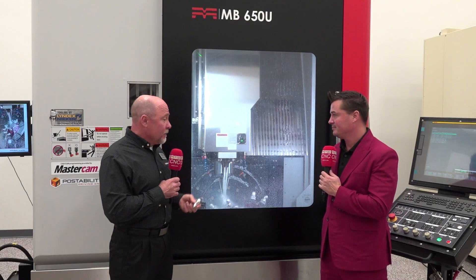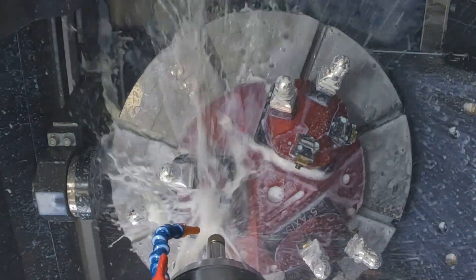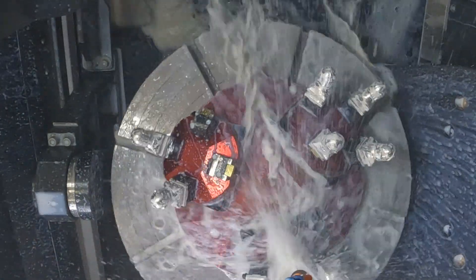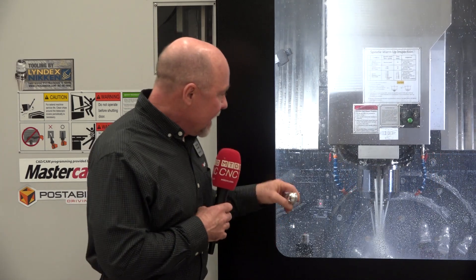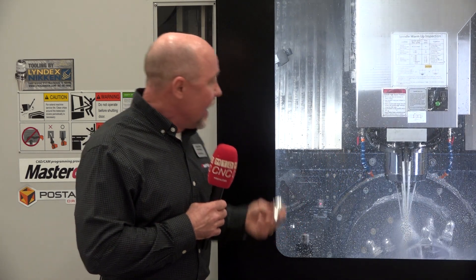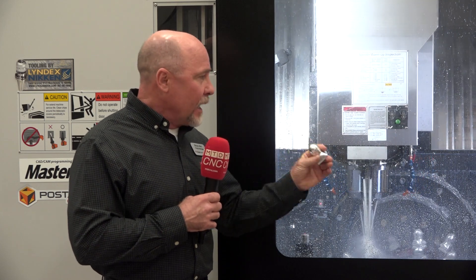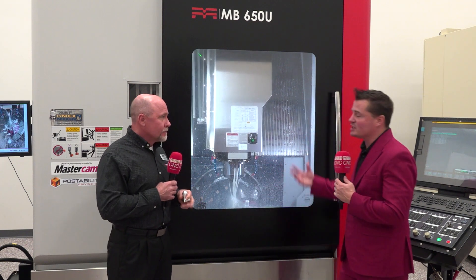It's extremely easy to set up with this work holding. This machine's fully loaded — you've got a spindle probe, laser tool setting. Load your tools, hit go, probe your workpiece, and go. Very quick setup time. And this is modular — you can change stuff out very quickly, go from four Mandos to two or six, or a different job really quickly. With 60 tools, maybe you've got 20 standard tools set up for each job, so less changeover. And if we get creative, OP10, OP20, OP30 — it's a five-axis machine, so maybe you don't need that, but it could mean three different jobs. There are just so many different games you can play with the capability of this machine.